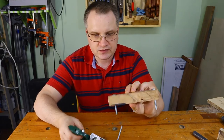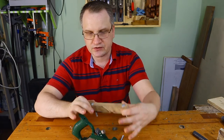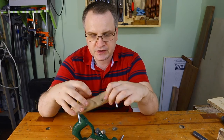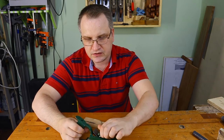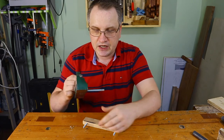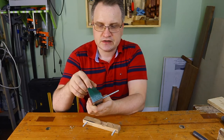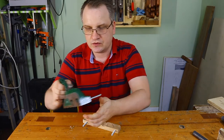You just need to secure this part, and now you have the ability to secure something to the plane. So this piece is one of the critical pieces that has to be very tightly attached to the plane so it can actually be a reference that you can attach something else to. The design is very, very simple. With one exception - I had to cut out a part for the blade. The blade on the Stanley 78 and the chip breaker are not 100% flush with the body, which is intentional. So you have to have some play or ability to move this blade a little bit out of the body on this side. Same with the cap - the cap is not necessarily flush with the body, so you have to have some space.